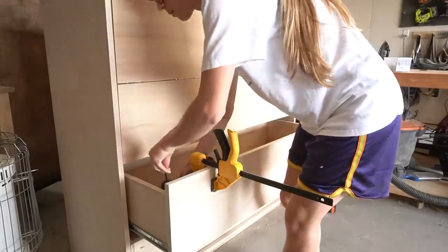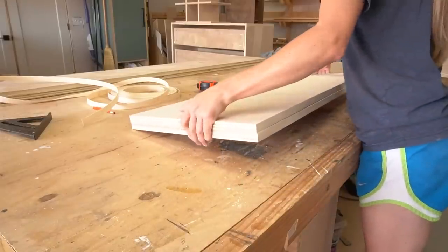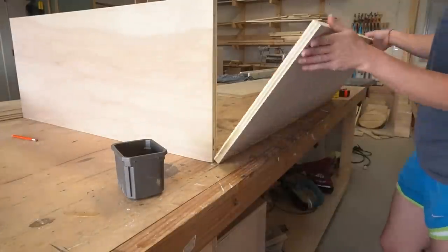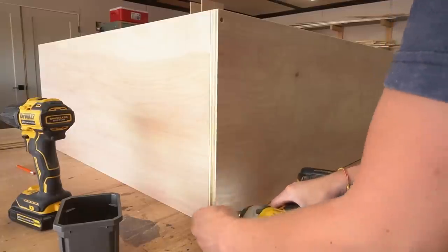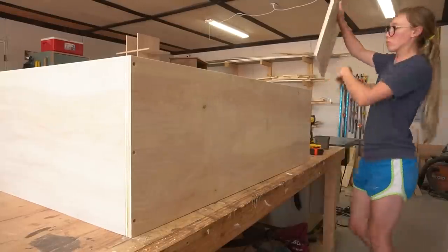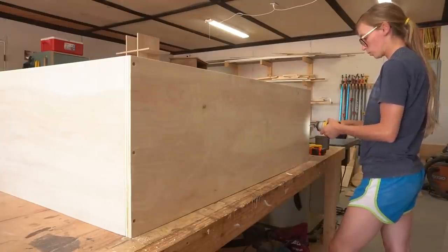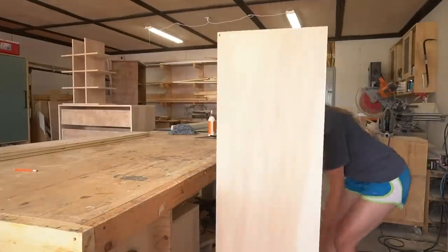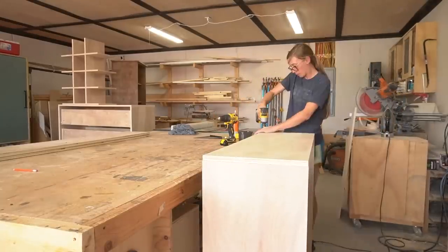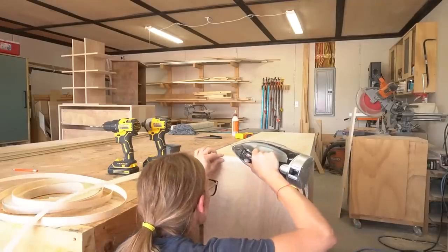I did go back and add a quarter-inch plywood back panel onto the back of this cabinet. Then it was time to move on to the top section. Just like the bottom, the top was basically a large plywood box, but I cut the pieces a few inches narrower — the bottom was about 20 inches deep, but I made the top section about 16 inches deep. I simply glued and screwed these pieces together. I took time to edge-band the front edges of the plywood, but I forgot to wrap it around to the sides on the top and bottom pieces, so I had to come back and add that after the fact.